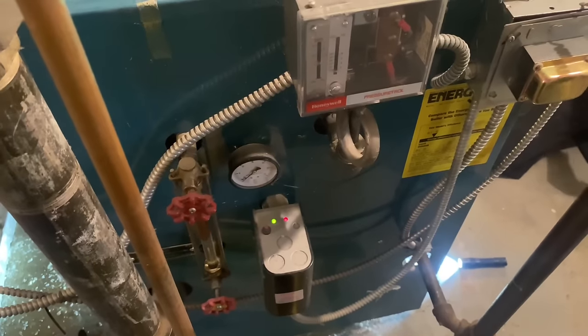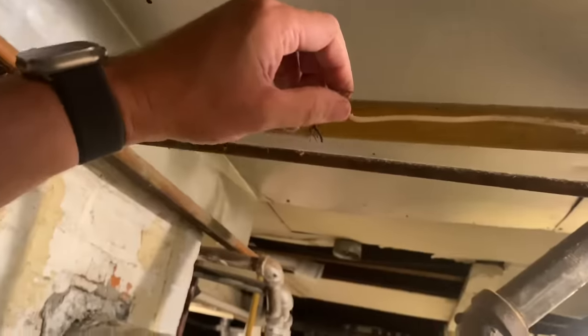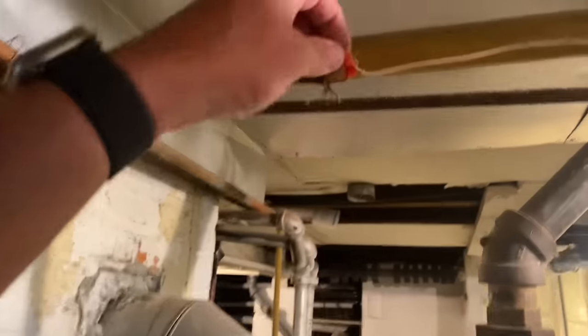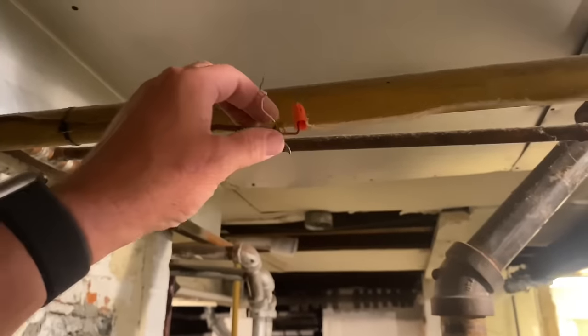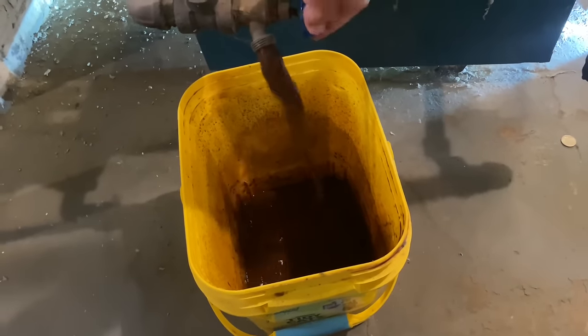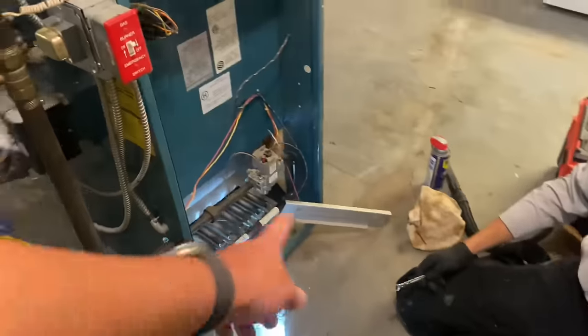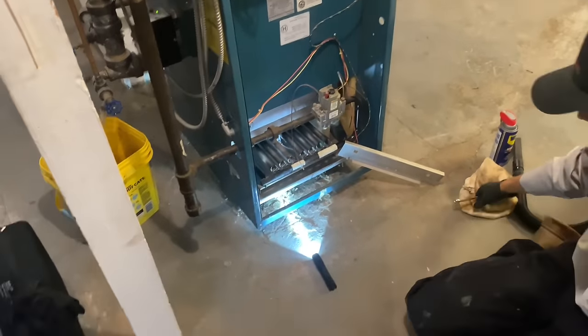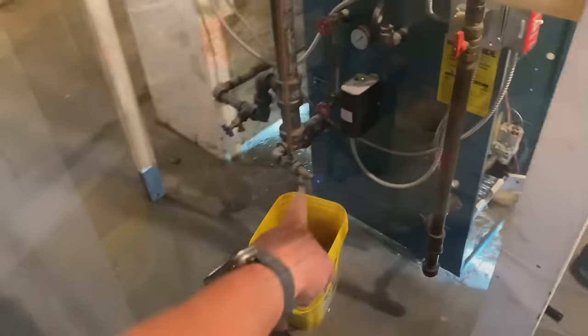Let's wait for the lower cutoff to finish — watch. That's the thermostat relay clicking on or off. Right now the power's back on, my thermostat is open — it's an open circuit — and now it can drain down and test our low water cutoff with the power on. The burners are all back in, and next we're going to change the thermocouple while I'm draining down the boiler.